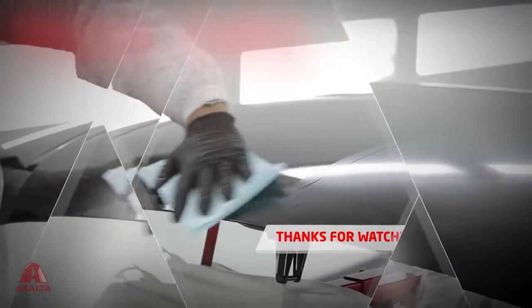They knew the coatings were strong and durable, but they saw the failure in the beginning and decided to ignore it — maybe sealed over top of it, maybe even put some adhesion promoter down on top of it. Whatever they did, they didn't follow the best practice. If the coating is coming off, yes, it may take an extra 10 minutes or so, but once they remove that coating, they treat it as raw plastic. And now they're going to have a durable finish because they're following the best practice procedures we give them.